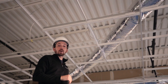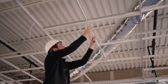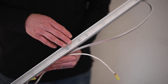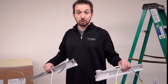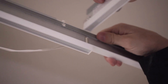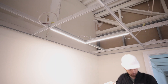In this section of the ceiling, we want to do a geometric T of light. To accomplish that, we use a 4-foot T-Bar LED intersecting with a 2-foot T-Bar LED at its midpoint. The T-Bar LED 4L model has 2 feet of light and 2 feet machined flat to replicate the grid. Because cross T's never intersect at the ends, the 4L allows you to intersect a T-Bar LED at the midpoint of another to create 90 degrees of light, allowing you to design geometric shapes and step outside your typical linear installations.